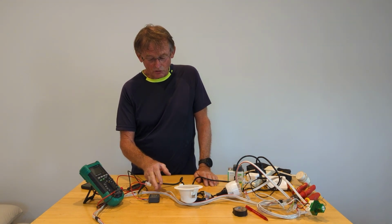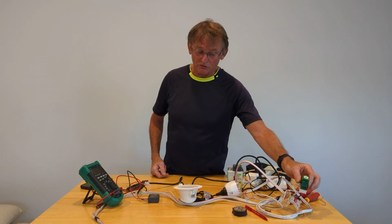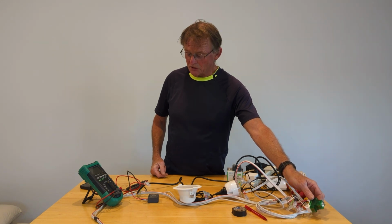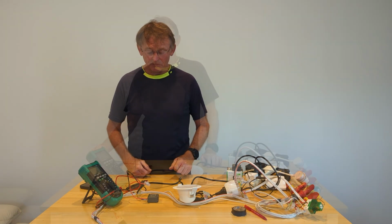Now, this relay can control one light, any 10 amp load up to 10 amps. It can control via that contact. It doesn't interconnect with these iconic switches. So don't think you can put an active on the relay and take the output and connect it to the control terminal. That will not work.